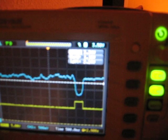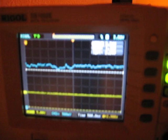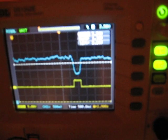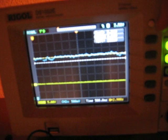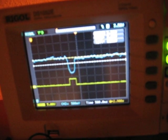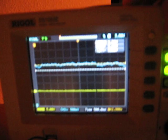The yellow line gives the output for my operational amplifier, my op-amp — there it goes, a nice square wave. The drop in the blue line is approximately 1 volt, and the difference between the average voltage and my trigger is almost 350 millivolts.